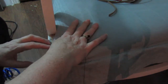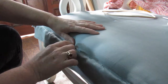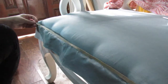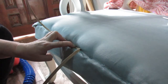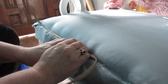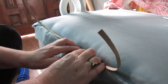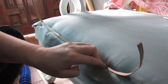I might have to staple it and then take the staples out as I go - this is a bit dangerous. Just managed it - well done. Then put the next one in. I don't like doing it like this because it's a little bit concerning for my fingers. Working on the front - if I pull this forward it does actually come in a little bit more. I'm going to take this staple out here - I call them pins because I'm pinning everything into place just for the time being. Here's my card which goes all the way along - the center is about here. Put that down, push that in, and when it's in place secure it. Because this is going along the front I can pull it in a straight line, but I'm also pulling out to the side.